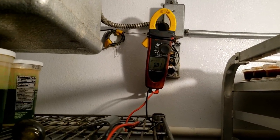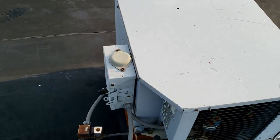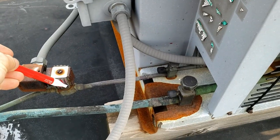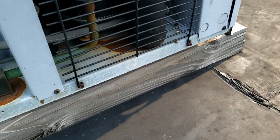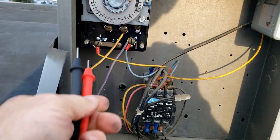Let's go upstairs and see what's going on up there. Nothing's happening — the coil doesn't feel warm, it's getting some power but don't know if it's enough to make it run. Three-phase. Over here on the side — that's never good when you see the panel for the compressor popped off the top. That's a little concerning. Appears that we're in a defrost.